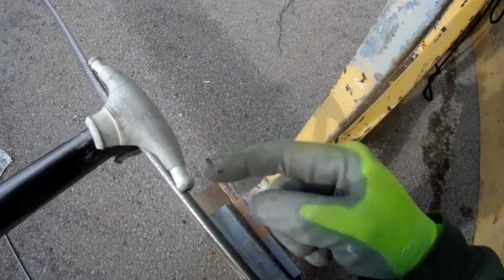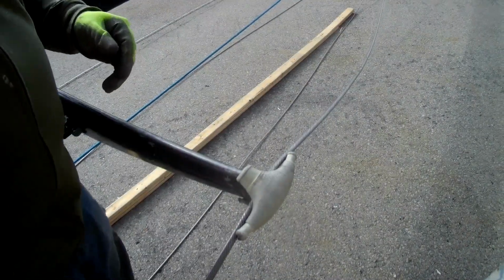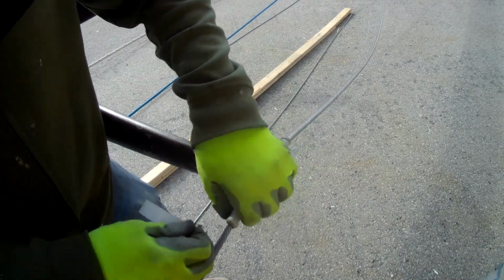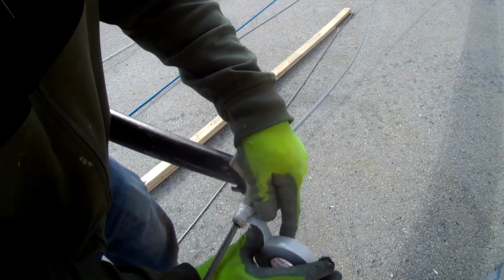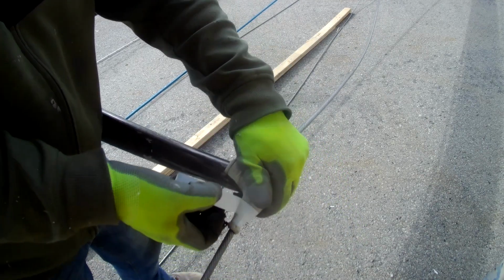Yeah. Basically these are put on so that when the sail goes by, it just doesn't clip anything and tear the sail. And then I just use typically white tape to tape it on so it doesn't go anywhere. I'm sure there's probably a professional tape, but this is just what I've been doing. Every year I take them off and inspect them. And I think next year or the year after, I'm probably going to need to replace these.